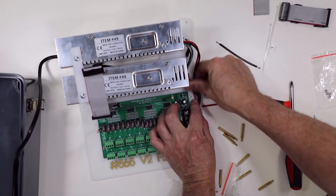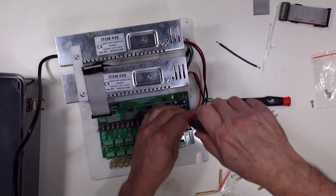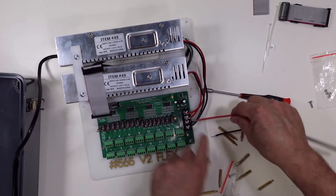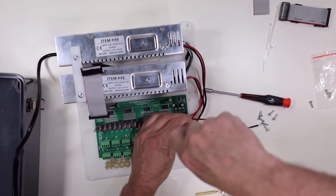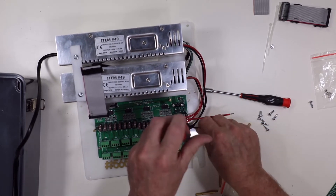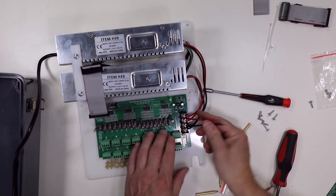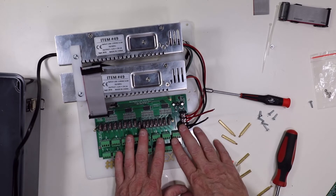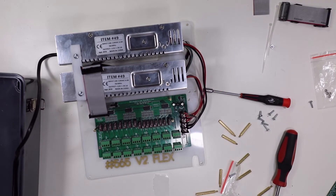You can see now that we've got all our cables here, nice and clean. I need to go back and add one more cable — I forgot to do this — and I'm going to add in these two extra wires. This is the beauty of these screw terminal connectors: you can add in two wires. Now, this is because we are running this off of one set of power supplies and we're going to need to get our power up to the long-range board.